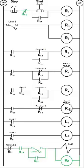And the way that happens is the contact for this is up here. Oh, look at that. Yeah, it's a normally closed contact. So that actually becomes open, which terminates the holding circuit. It terminates that original signal that was being held from the start button, and that opens this. That then terminates the memory of it going out for the first time. Because that is de-energized, that becomes open, that kills the first count. Now, this also opens, which terminates the memory of it going out for the second time. That becomes de-energized, that opens, and that kills the second count.